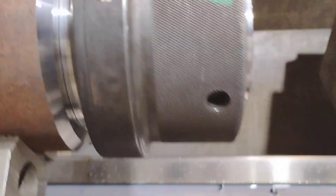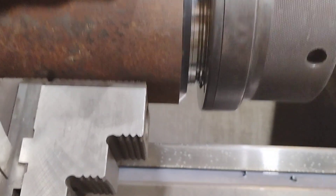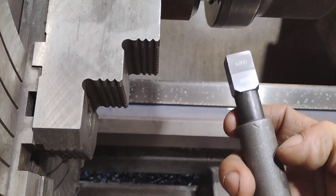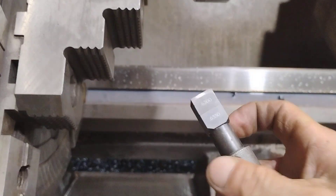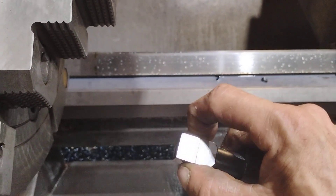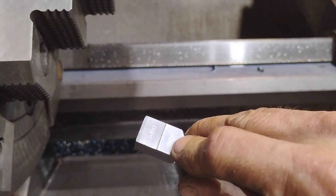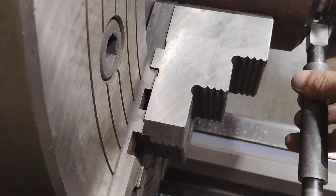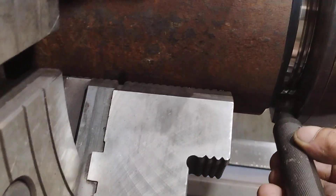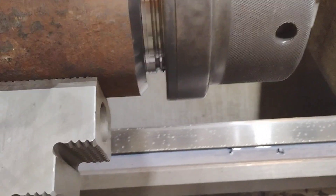We use hard ground gauges to gauge our connections. On this go/no-go stick, this side gives you 0.620, this side gives you 0.625. This is your max at 0.635. You can see 0.635 goes in, so it's too big — I need to take another pass or two.